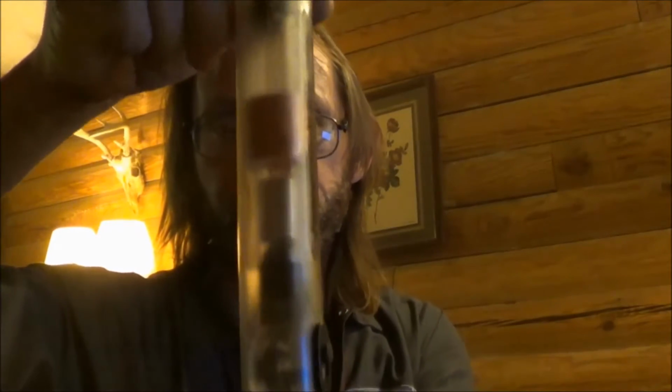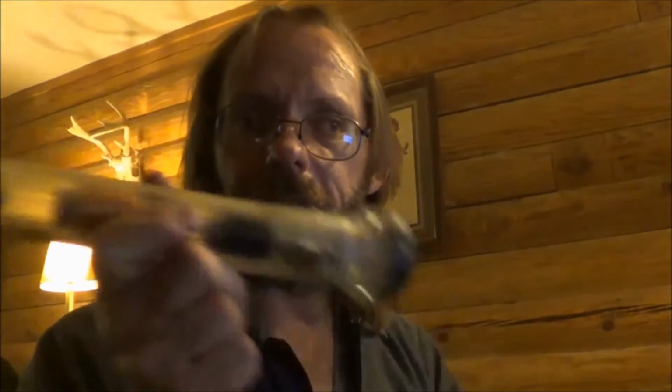This one doesn't have the repelling magnets on the ends. It's just got rubber bumpers in there. But it's the same general principle, still going through the coil of wire to charge the flashlight, and it works also. And this one I've probably had close to 15 years also. But the nice thing about this one is you can unscrew the cap, and it's got an O-ring in here under the lens to seal it and make it waterproof. Both of these are waterproof, but this one you can actually take the lens out and use that to start a fire. Put that back in there.